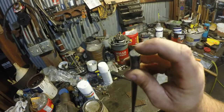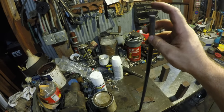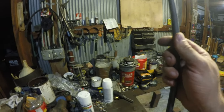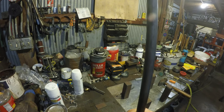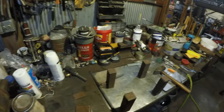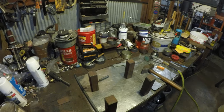I'm going to cut a couple of these pieces - they're solid steel - and I think I'm going to tap them for 6mm by 1.0 pitch, then run these as another standoff and run a flat piece of steel across the top of the battery. I could drill the bottom of the battery box and just run a bolt up through the bottom. To take the battery in and out I'd just undo the battery cables and slide the battery out towards the side.